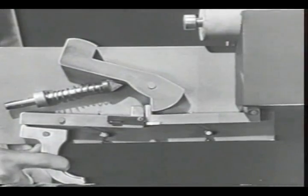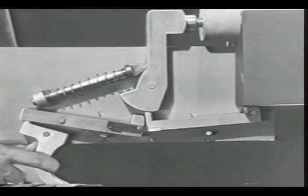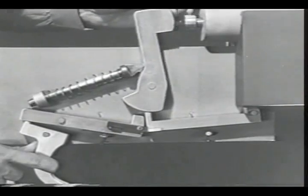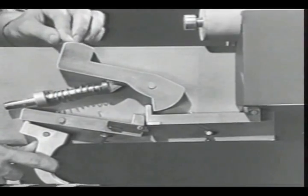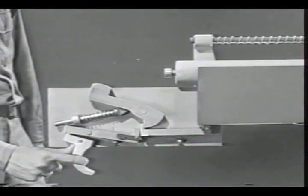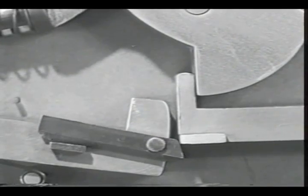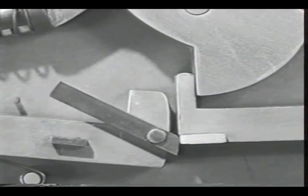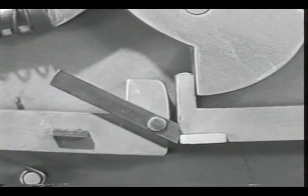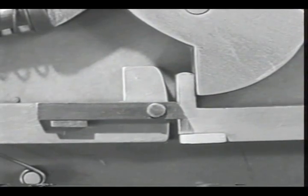Let's see it again. The sears come down together releasing the hammer. The new sear snaps up and catches the hammer even though the trigger is still held back. To fire the next round we must release the trigger — the link hits the lug on the new sear and pivots. After it passes the lug it drops back into its original position and the firing mechanism is ready to fire the next round.